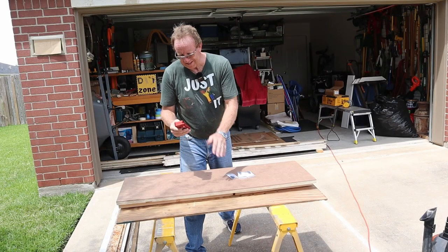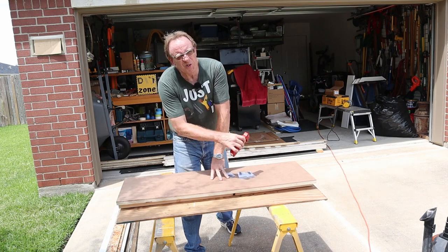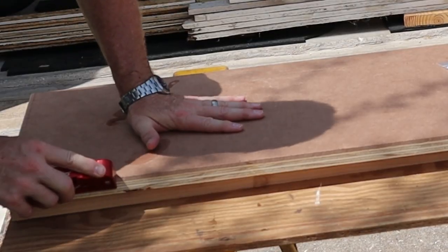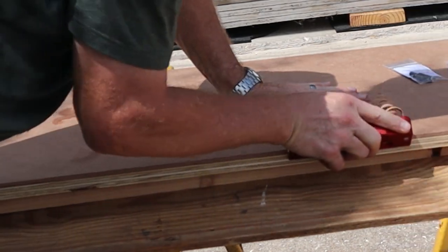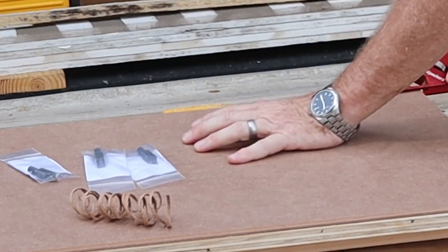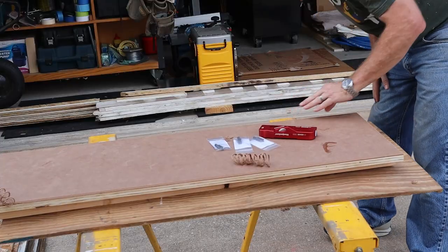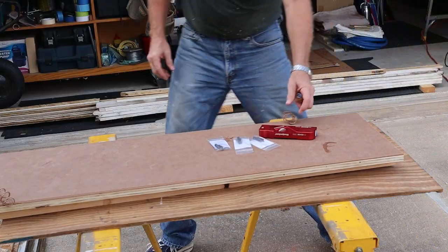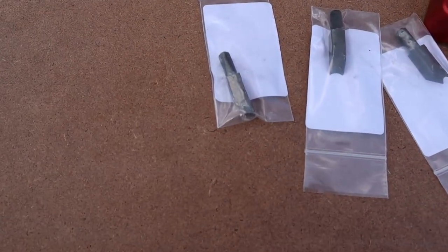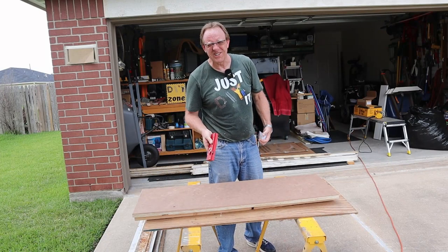It's designed to perfectly sit around the corner. When you set it and go over it, it only needs one pass — when you come back and try to cut again, it won't cut, so you have to adjust it to cut again. This MDF is pretty easy. A nice chamfered edge. Here's all the mess — easy to clean up, nice chamfered corner. Here are the other radiuses you can get; I'll have a link down below in case you want to check it out. It won't be an affiliate link but you can still check it out.